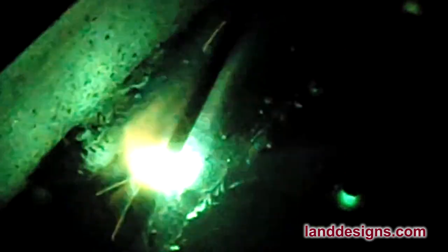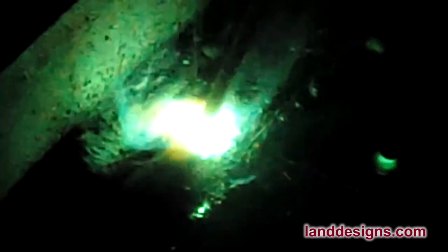It's angle iron I'm welding on, and it's about an eighth of an inch thick. I did try it with some 6010 and ended up blowing through it. Within about an inch the metal heats up as you weld, so the farther along, the metal gets hotter, and I ended up blowing through it. I did a few beads with some 7018 as well, which is a really nice rod to use as long as your metal's nice and clean. This is what it looks like when I weld a bead.